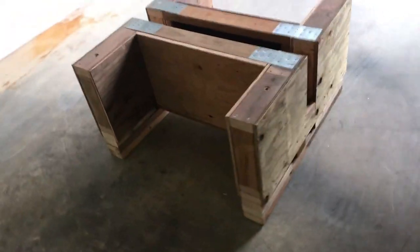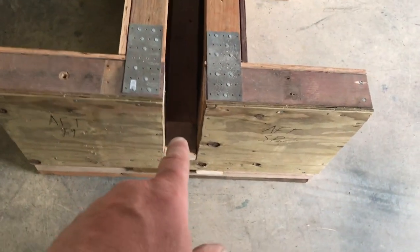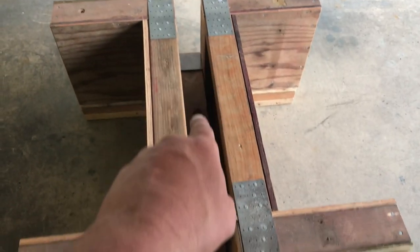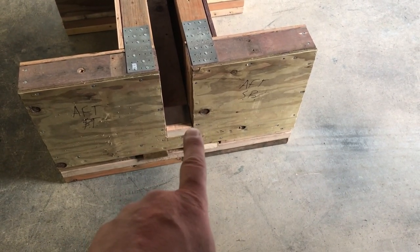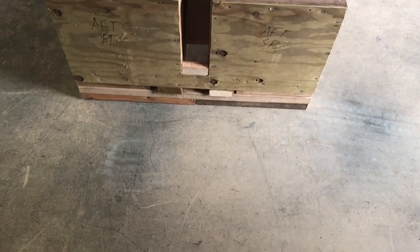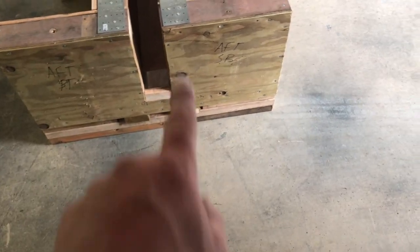Okay. Well, I think I took care of it. I took those plates out and then I added a 2x4 inside the slot. So that doesn't make this 12 inches anymore. It makes it, would that be 10.5 inches, which should be sufficient. And then I added 2x4s going this way along the bottom of those walls. That gave me 1.5 inches.